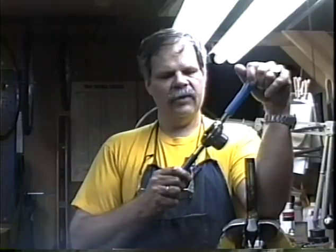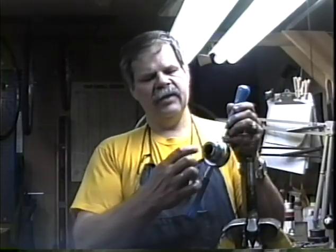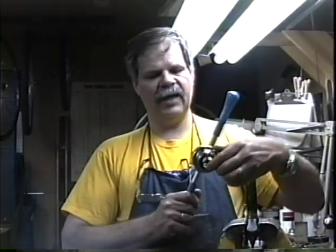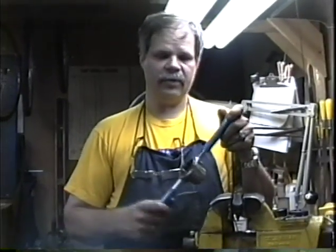This is another tool that I prefer over the Campagnolo tool. This is the steering column die in the center and the die holder. There are a couple of reasons I prefer this over the Campagnolo. Number one, it's a very versatile one. You can take the guide out of here, and you can take the die out of here, and you can get different sizes to fit different size steering columns. For example, here's one for 1 1/4". That's the guide. And here's the die for 1 1/4". And you can also get a 25 by 1 for French. You can get a 1 1/8 cutter for mountain bikes, and you can of course get the British one.